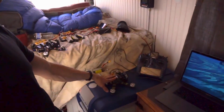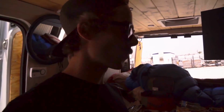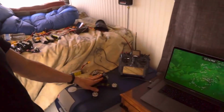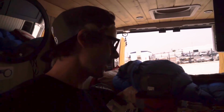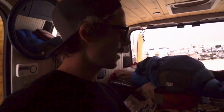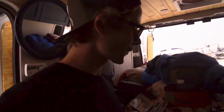So again, I have 4 brand new quads here. This is the only one that's old, that's my favorite, and I'm trying to make things work again. It's been frustrating me because I've had this quad that's been super buttery, and I've not wanted to fly the new quads because they just had vibration problems, and I think I figured out why. It's because the motors are inconsistently noisy, especially with the pre-production model motors. So I'm going to go ahead and just swap out all new motors on there.